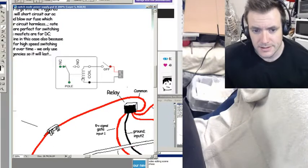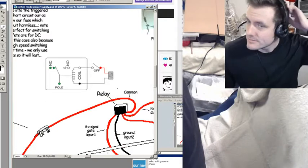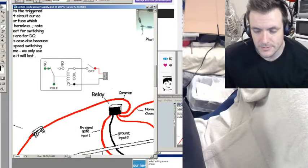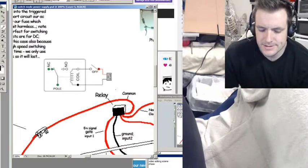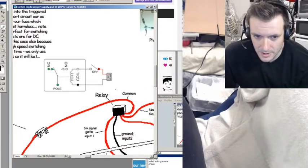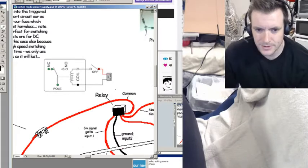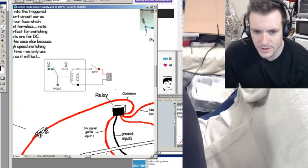This magnet is called an inductor coil. An inductor coil is just copper wire wound into many many windings — maybe 6 to 10 windings, or possibly a lot more depending on the design. Through the center will usually be a ferrite core, which is like a heavy metal core designed to concentrate the magnetic field and increase the inductance of your inductor, creating a more powerful magnetic field. It amplifies it by trapping more magnetic field in the coil and preventing it from leaking out. The tightness of the wraps also helps trap more magnetic field.